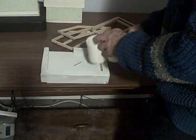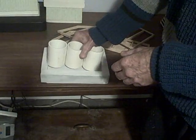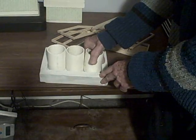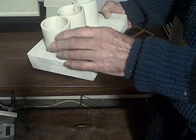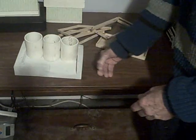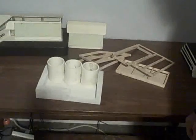We're going to need insulation for these drums. These represent 2½ feet in diameter, but the actual drums are only 2 feet in diameter. So in a space like this, you'd have space left over — on the sides, that's where you'd put 4 inches of solid insulation, probably isocyanurate, on the front side, back side, and sides. For the top of the drums, you'd just put a piece of insulation. This is what I like to call a sunshed — a method of collecting and storing solar heat in the same structure.